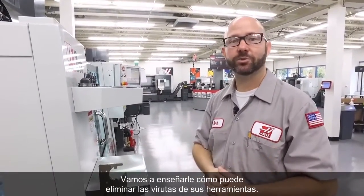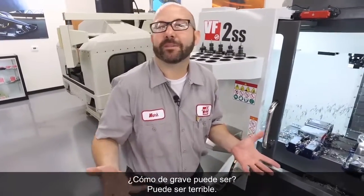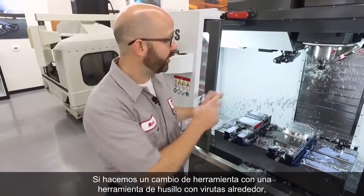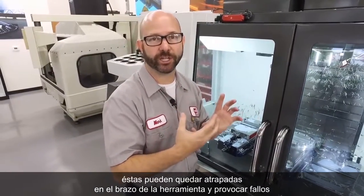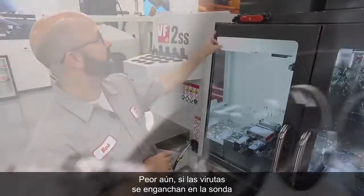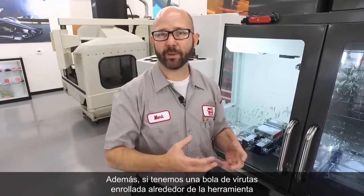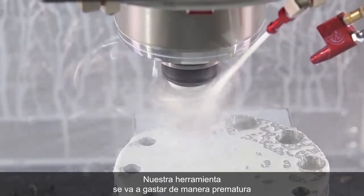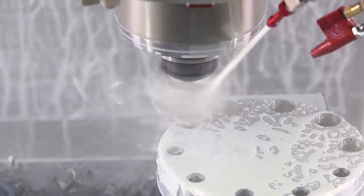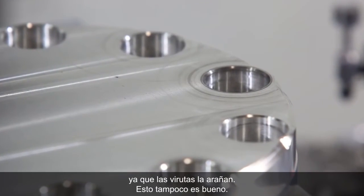We're gonna show you how you can get rid of the stringy chips on your tools. So we've got a tool that's got chips wrapped around it — how big of a deal can that be? Well, it can be awful. If we do a tool change with a tool in the spindle that's got chips wrapped around it, those chips could get caught up in the tool change arm and cause a fault. Worse than that, if those chips catch a hold of my probe in the tool carousel, we could have problems with that as well. Also, if we have a big ball of chips wrapped around our tool, those act like a force field, keeping all the coolant away from our cutting edge. Our tool's gonna wear out prematurely, or worse than that, it could break because it's running dry. On top of this, we've all had parts that ended up with great big swirl marks across the face as those chips dragged across the surface.